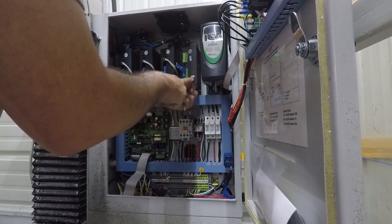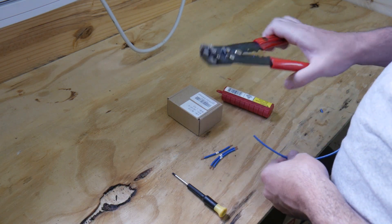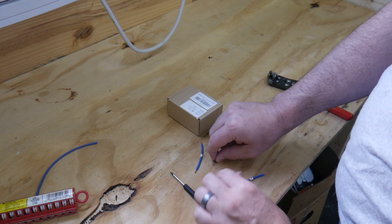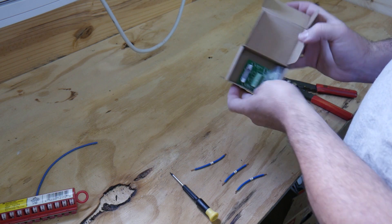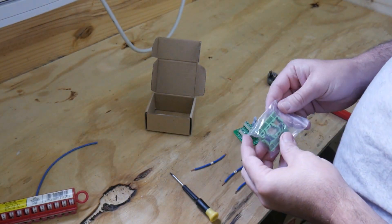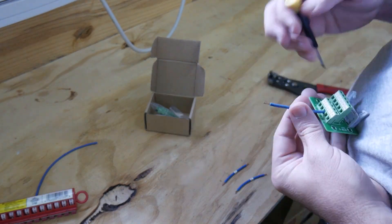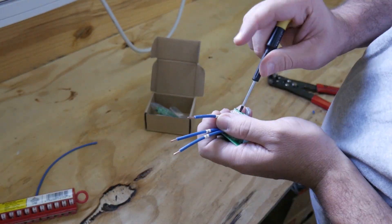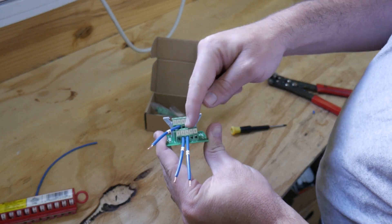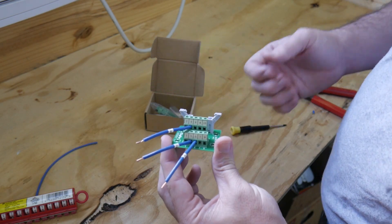Stay tuned — I've got an IDC breakout board coming so we can hook it up here. Okay, just take some blue wire, cut it, strip it, and boom — number it. We've got three, four, five. Pull out your IDC breakout board — these are for attaching to a DIN rail, not doing that right now. Depending on your make, depends on how they actually break it out, but in my case we've got three, four, five — that's how I've got them numbered. Matches up here, it's real easy. They're not going far, so let's get her in the Tormach.